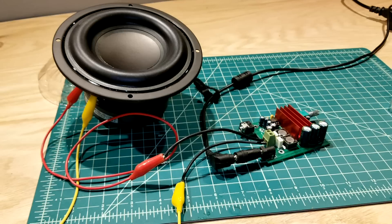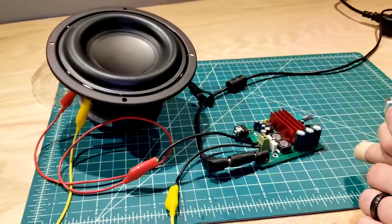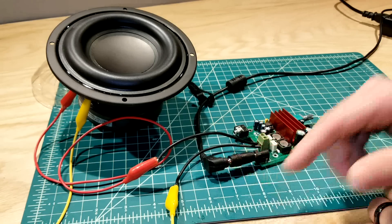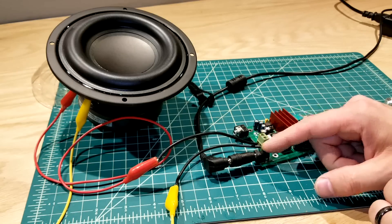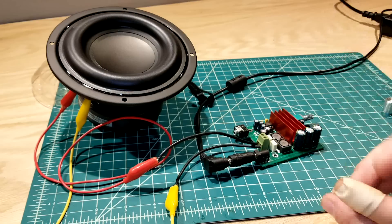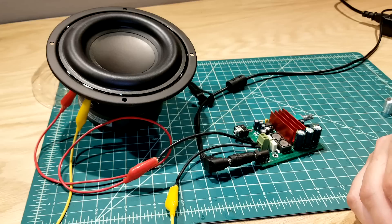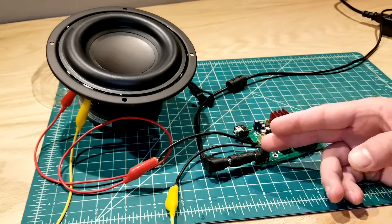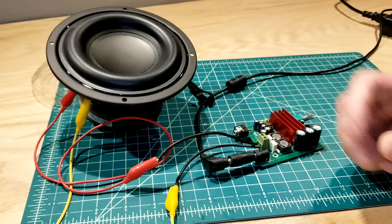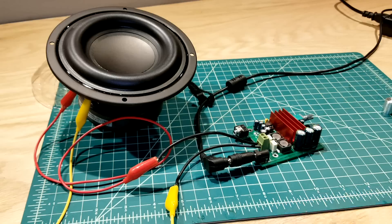All right, everything is hooked up. You'll notice a couple of things. One, this is very loose on the board — that probably needs to be re-soldered, which is usually what you get with a really cheap quality component. I also plugged in this power adapter, which adapts from 2.1 to 2.5 millimeters. I think they really missed on this — they used a 2.1 by 5.5mm power jack, but really any power supply over 12 volts almost always uses a 2.5 by 5.5mm jack. A lot of you will just solder power directly onto the board and bypass this anyway, but for those who don't want to solder, you have to buy this extra adapter for any high-voltage power supply. That's the first thing I don't like about it.